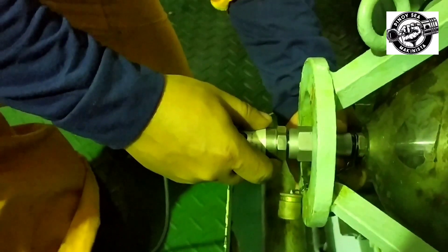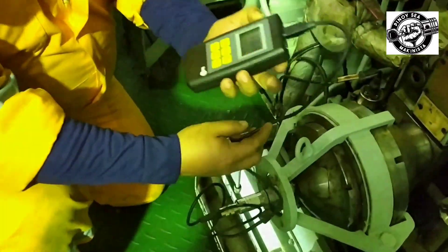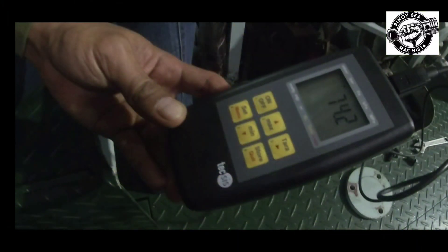Remove the mini-mass cup. Mount the pressure gauge connected with the mini-mass hose on the accumulator at 0.455. Check the pressure, and it's 7.42 MPa, which is lower than the regular pressure in the table.